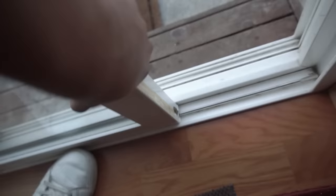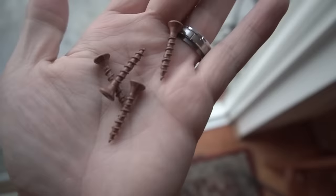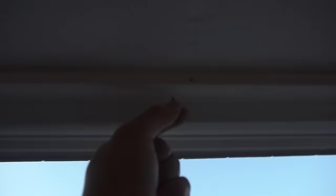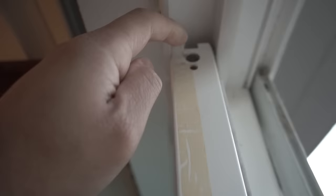Like I showed you before, just lifting this door — see that huge lift? It's because there's a big gap up above. You should want to eliminate this gap. The best way is to insert some screws on the top rail. The screws I'm using are about one inch — wood construction screws. There's going to be two on each side, so I'm going to install one here and one beside it, and maybe one halfway — a total of about six screws. When you're screwing up above, you can adjust them to the right proper height so the door won't run into them.